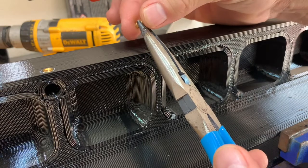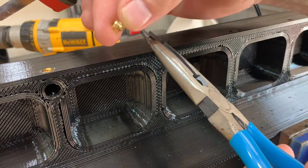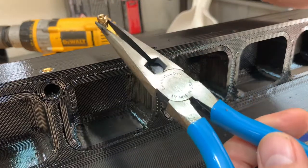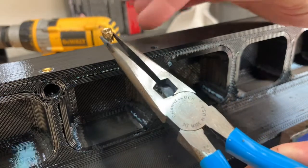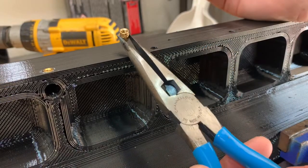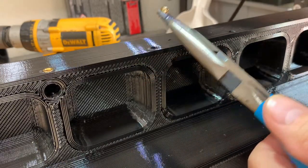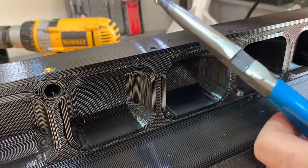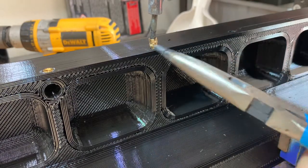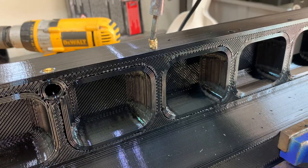The idea is you're going to put the soldering iron against this and it's going to heat up this brass. The brass is not hot right now — I can hold it with my hand. You can see how fast this is going to heat up on its own. I don't need a press to do this because I've got a couple flat sides on the insert and a flat surface to judge alignment from. I'll put it up against the soldering iron and then stick it in and hold it in place.